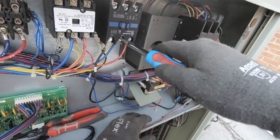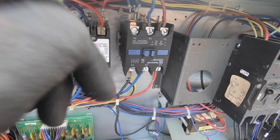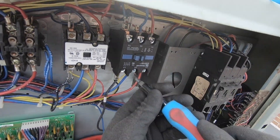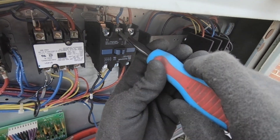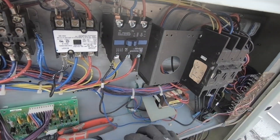For one main reason — look at how much further the lugs sunk in here than here, because the fat part takes up a lot of space. So just make sure you snug these down. Don't kill them because I have cracked them. Tight. We don't need those loose.